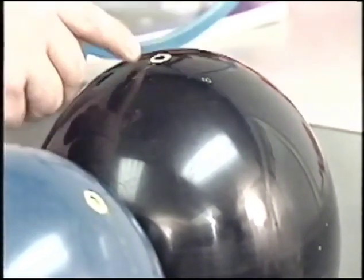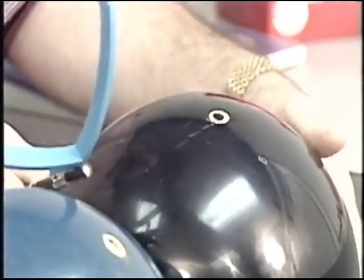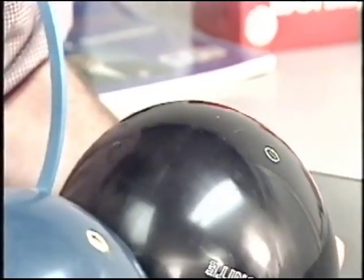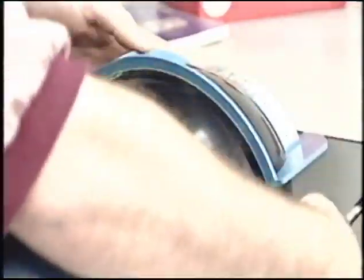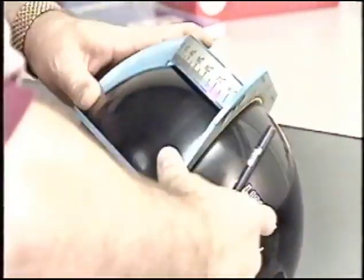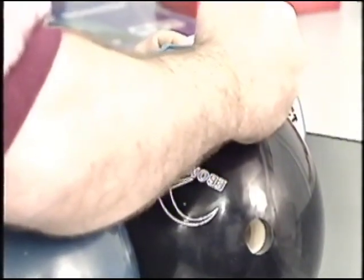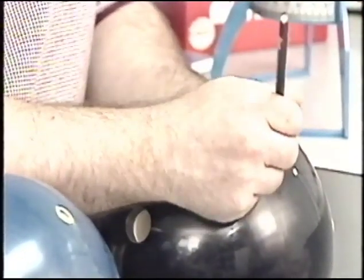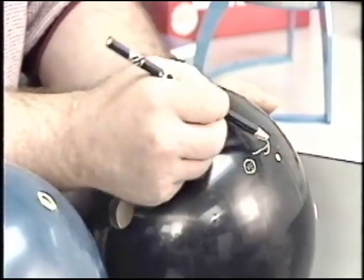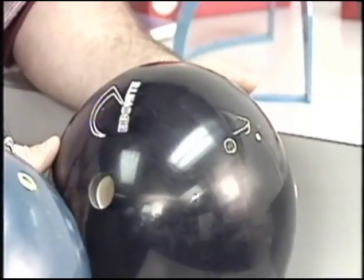Okay, in the eight ball, preferred spin axis moved about 2 inches. Let's create our mass bias. Connecting the pin and the preferred spin axis, the mass bias is 90 degrees to both. Original mass bias after drilling three holes for the grip.